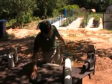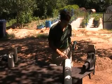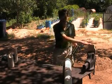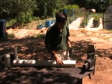Now to make it stretch, we take a heat gun. Now this is used for paint stripping, it's pretty widely available, or you can use a hair dryer if it gets hot enough. And then we're going to heat about the first 4 inches here this way. We're going to keep this moving, get it hot, and then we're going to stretch it over here. You want to keep the heat gun about 1 inch to 2 inches away from the pipe.